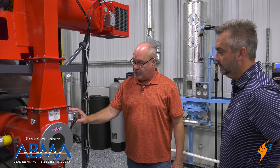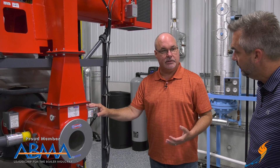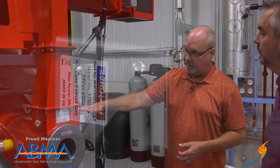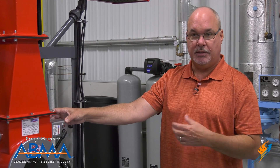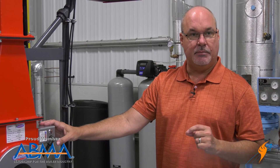What's unique about the Autoflame design is they're very accurate — 0.1 degrees of accuracy — so it's complete control the whole time. They're built to military specification, so they're very durable and we don't have a lot of these fail. Another unique thing is that most people have a potentiometer in their gearing system, whereas Autoflame has a potentiometer that's directly on the shaft. So even if you have any gear movement, it's irrelevant because we're monitoring the shaft turn — we're dead on all the time.